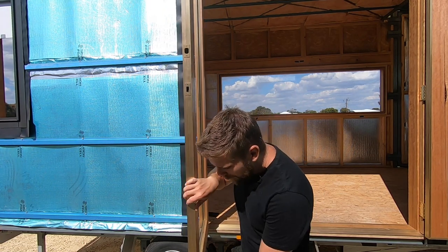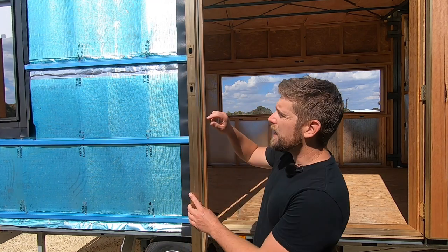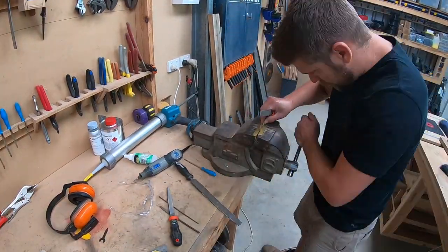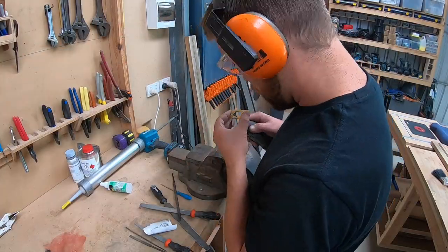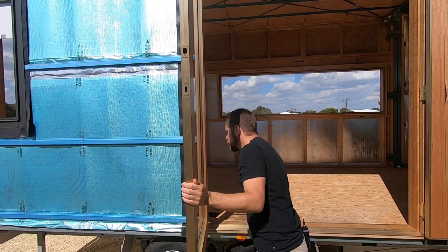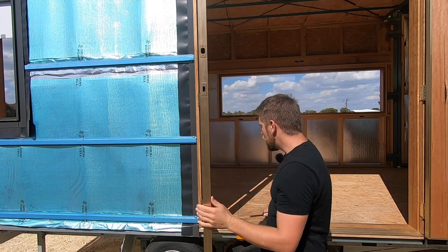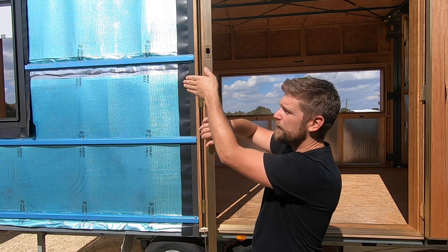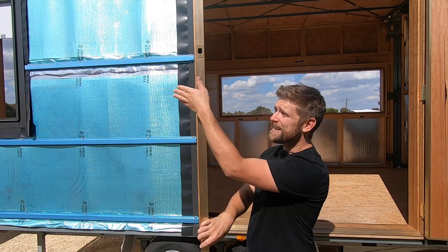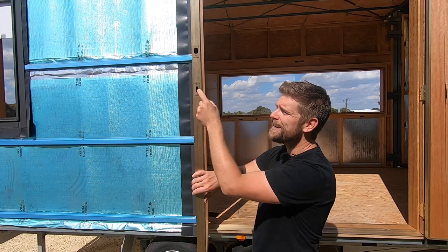The side door is much the same as the other one - it's timber and glass capped in brass. The recessed bolts are recessed into the edge of the door so they can't be accessed unless that door is open. I've made up my own strike plates for the dead bolt and the side latch - and this just took so much time. The reason I did that is because it looks tons better than what it came with, and with the bottom one, it meant my strike plate didn't come out past the edge of the door, which was important because when the weatherstrip swings around, I would have had to notch in around that strike plate. The latch has no problem sliding against it, and it meant I could adjust the size of that hole so that when the latch strikes in, it lines the two doors up perfectly.